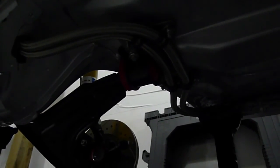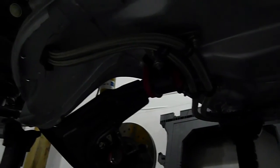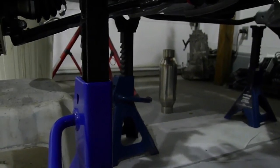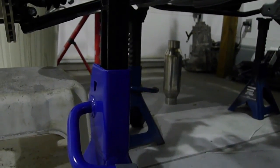It's going to get a little fuzzy because it's dark underneath the car, but I've been working on the fuel lines. They run under the car on that side from the back and then get to the front. I've made a couple of stainless steel brackets that bolt into the end of the A-arm assembly and then go up into the car. I've also got the exhaust system in and out a few hundred times because I'm working on welding in that little tiny resonator at the front where the catalytic converter would go. I want to be able to swap the cat in and out as well as that resonator depending on whether I'm racing or street use.